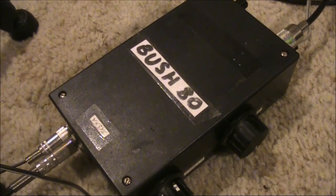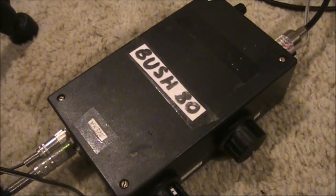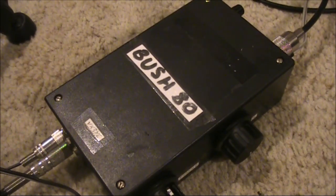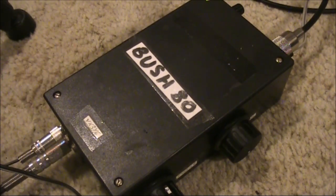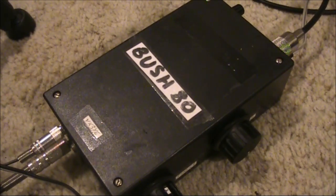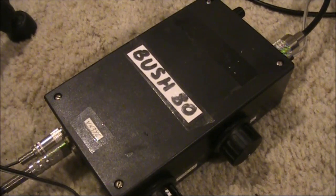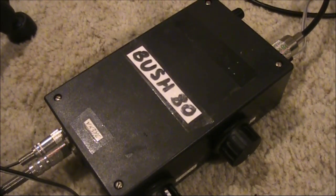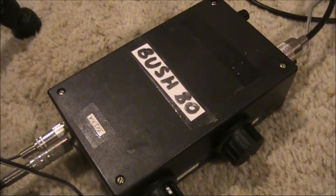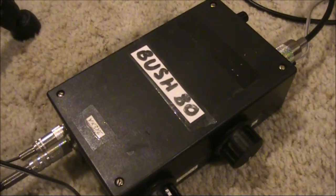So that's just a quick demonstration of a couple of watts on double sideband on 80 metres. Range is typically a bit less than on 40 metres, though there are certain times and distances when 80 is superior. But in cases where you want it to be very small, very light, and draw very small amounts of power, then the double sideband rig might be the better option. Ideally it would have a choice for CW when signals get difficult to copy. For the circuit, have a look at my website, vk3ye.com — the circuit is pretty much identical to the Beach 40 described on the website and in various videos.